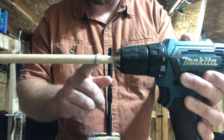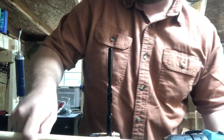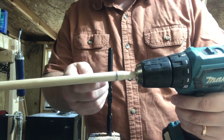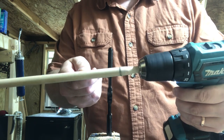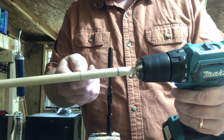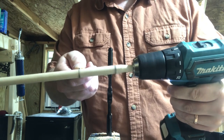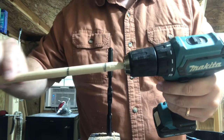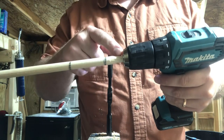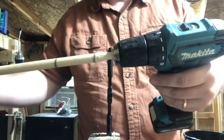Alright, so I've got the end mark closest to me. I'm actually going to stretch that out, because I want to make an area that's long enough for the flute. I'm going to make it a little bit longer than it needs to be — about two to two and a half inches. That's going to be our fluted end, so we're going to want to stop short here. I did pare down the wood a little bit to make it thinner to fit in the chuck, so it's good to go.